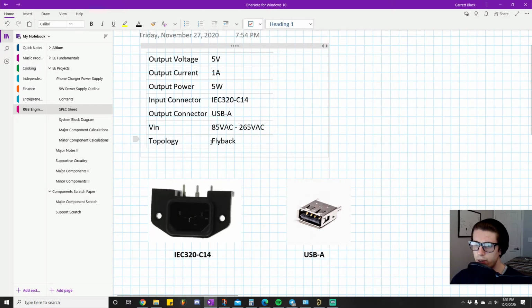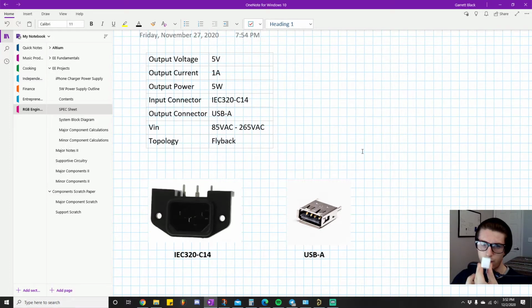The last part I want to mention is the topology. So this is going to be flyback topology, which kind of makes sense if you've been watching the last several videos on my channel. I've been talking about flybacks a lot, but beyond that, let's also talk about, well, why would anyone use a flyback in this case anyways? What are the reasons for it? And I would say there are two major reasons for using a flyback converter as an AC to DC converter.